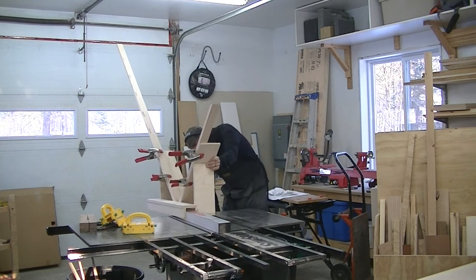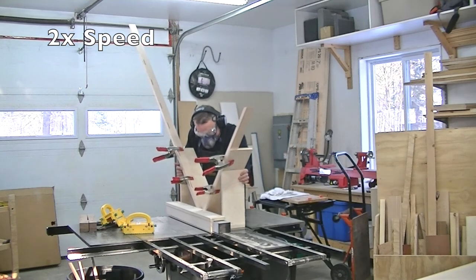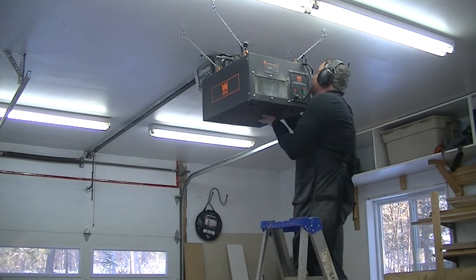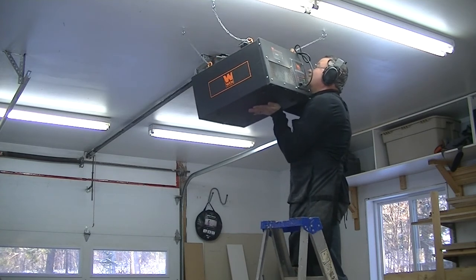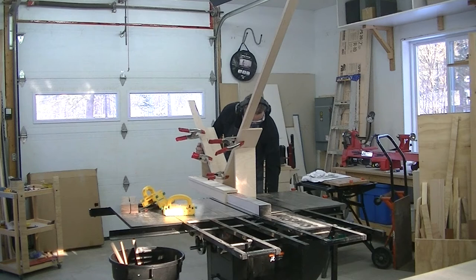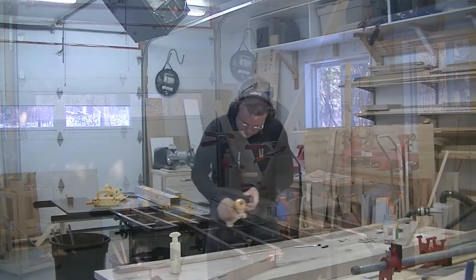Time to use my sled to cut the splines. I have one long edge and one short edge clamped in my jig. I set my fence to three-quarters of an inch and made the cut. Surprisingly, this cut was pretty tough on my blade — you'll see some smoke come out. I then flipped both edges for the bottom cut. I had to unhook one side of the dust collector temporarily to make the cut. Thank God I've got a high ceiling in my shop — the long edge is just over seven feet long, so even at 45 degrees it needs a lot of headroom.